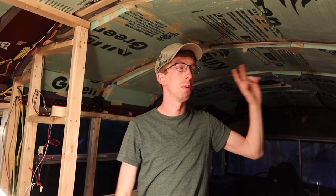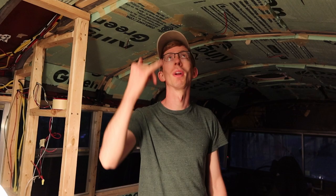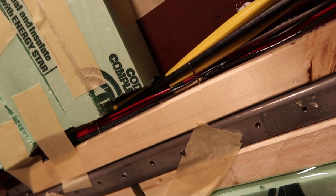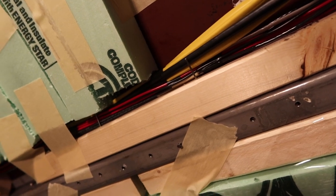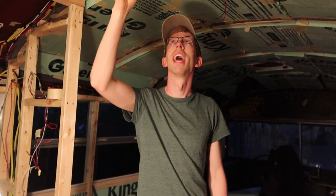And the masking tape that we bought is not doing a good job of even holding up the 2-inch insulation board. So to kind of solve the problem, what I did was I just took some small nails and tapped them slightly into our support beams, just enough to hold the weight of the wires. And then I could squeeze 7-inch boards into the two to kind of prop the wires in place on top of the nails. And I just wedged it all into place. And so now I'm just building a nice insulated column here next to the heavy wires. So not the most elegant solution, but it's working for us.